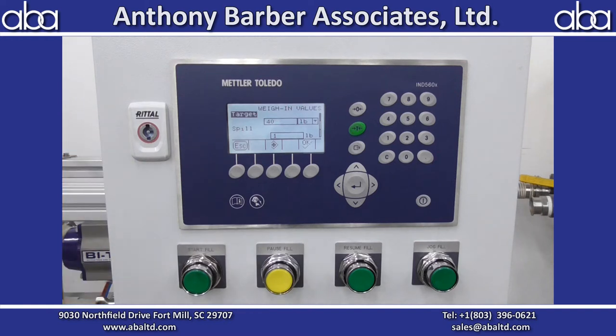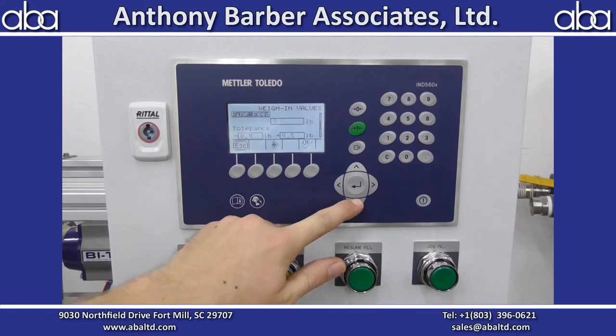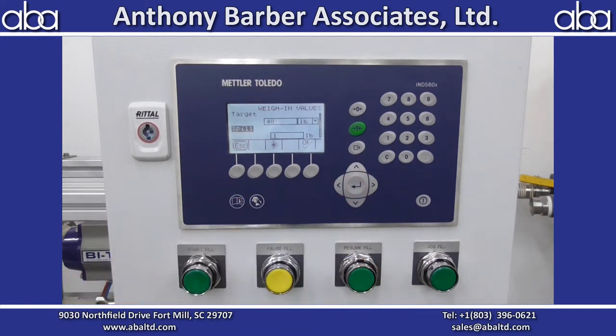The spill and such should be pretty close. You might have to change your target to 42 or a little off from your average. You can scroll down and adjust your spill and the fine feed. The spill is how early the fill head will shut off — right now the fill head will shut off at 39 pounds, assuming you have one pound of product between the container and the fill head when it shuts off. Things that affect this are the density of your product and how high above the container you have your fill head. You want to keep the fill head height about the same every time you switch between ones and fives, because if you have it way above, the spill is going to be a lot more than if it's really close.